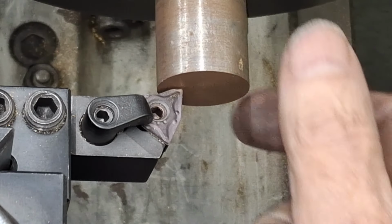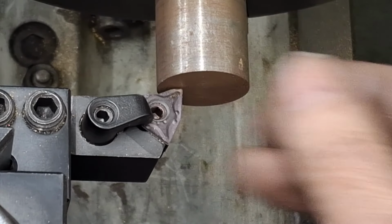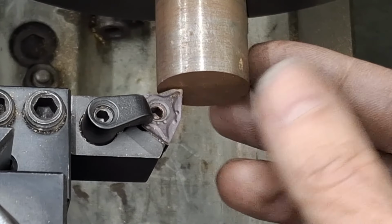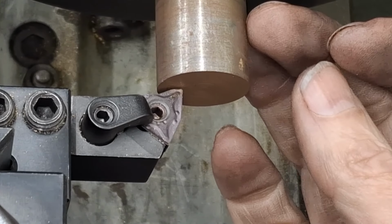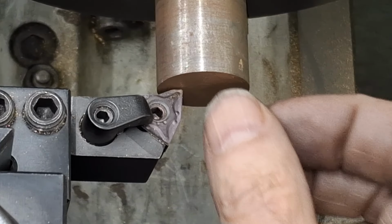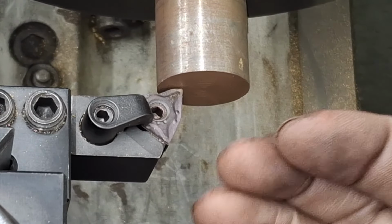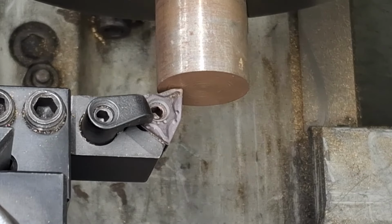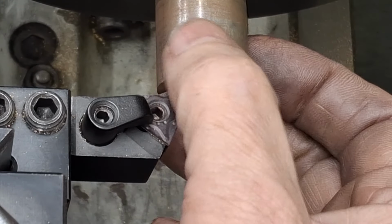Righto, guys. In the lathe now. Just a chunk of 24 mil steel. No idea what grade it is. Doesn't really matter. It's only making a mandrel. So we're going to face off. Go down about 16 mil. Don't forget, we have 17 mil of cast iron. So we really want that bolt and washer to hold it down tight. You could get away with 16.8 mil, I suppose, but 16 is close enough. And we get that down to 10, which is going to be a nice fit.